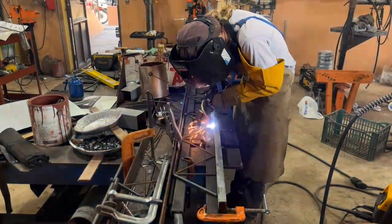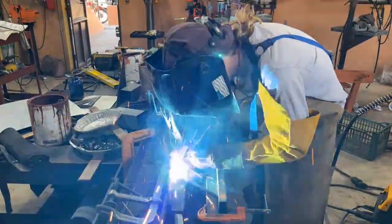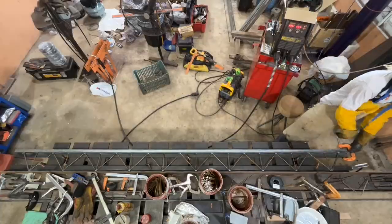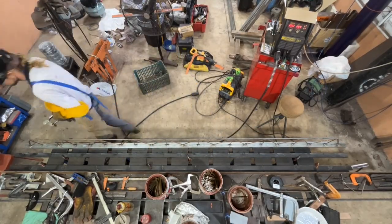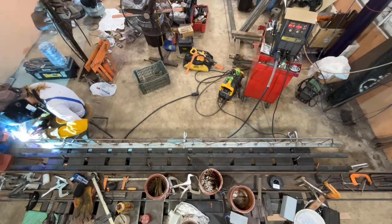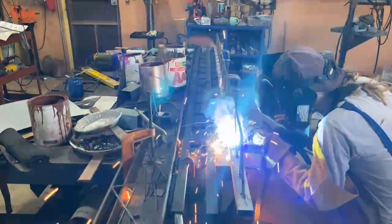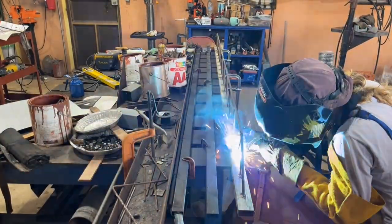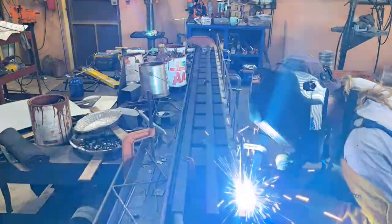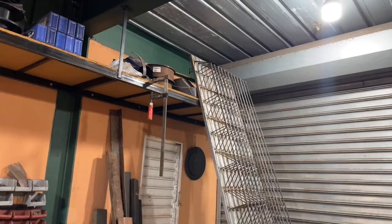A common replacement in the industry is thin-gauge galvanized C-channel, often used for floor joists or purlins on large warehouses, made in roll-forming machines. In my case those were more expensive, and installation was harder because I wanted them to sit on top of the beams rather than on the sides. Attaching a channel to the side of a beam requires welding or a bolted flange — more effort — whereas bar joists are easy to set right on top and fix with screws or welding.